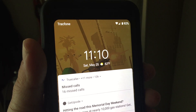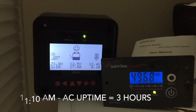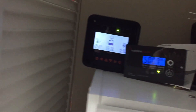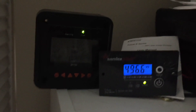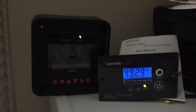It's just after 11 o'clock in the morning and the batteries are still holding up fine at 12.5 volts with the AC still cranking. I should also mention that on that same inverter I also power my light and my wireless HP printer, which stays on 24 hours and has a slight constant draw — plus I have the air conditioner running. The batteries are still holding up and the inverter isn't overheating or overloading, so let's keep on testing.